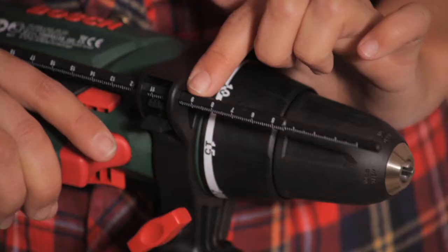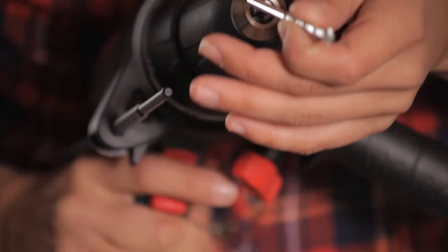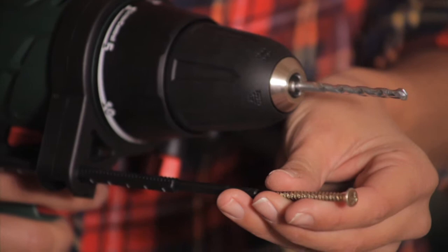This also helps very much when you're putting the drill bit in, because it will help you gauge how far you want to drill into the wall — and that depends on how long your screw is. It's a keyless chuck so you can do it by hand using one hand. As soon as it's in, just give it one extra twist to make sure it's nice and tight. Then you want to measure your screw against the line there to make sure you've got just the right length. That will stop you as you hit that length on the wall so you don't go too far.